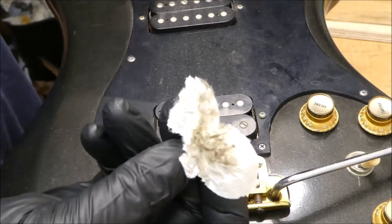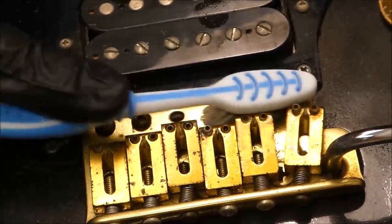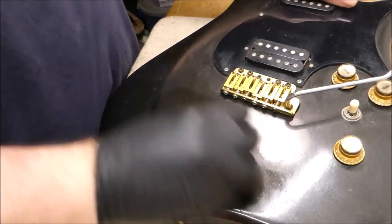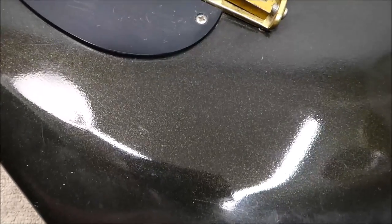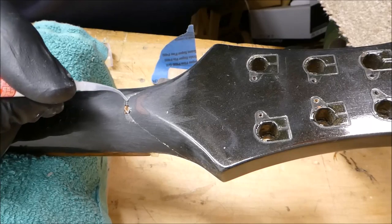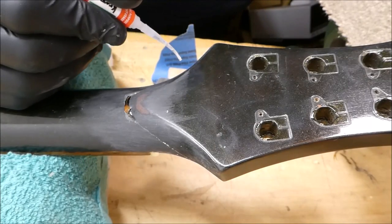Scrubbing through the worst of it with some naphtha — even got a toothbrush out to help in the endeavor. I actually had to use fine polishing compound to cut through the coating on the top surface; it was a film of grease or something. After cleaning and scuff sanding the area that needs to be repaired, I did some light pore filling over the bare surface of the wood, which is walnut, and also along the line of the crack using some thin super glue.